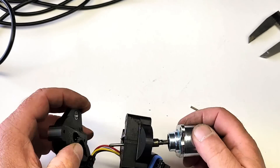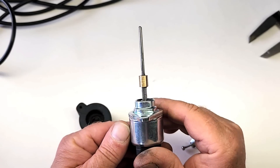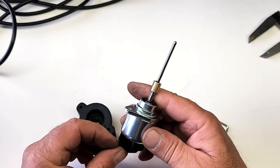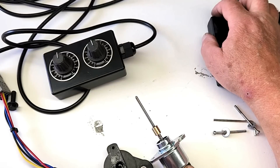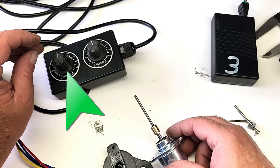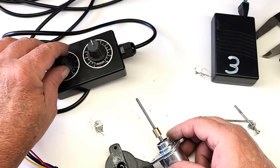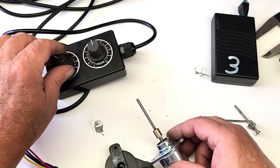Fast forward a few minutes and this guy is apart — the grease is normal, applied to the rod prior to assembly. The stainless steel shaft is press-fitted into a brass coupler, and the brass coupler is threaded onto the jack screw in the stepper motor. Let me show you how this works with all the stuff removed. The first movement is the device searching for home position. Once it finds home position, the step counter in the software is zeroed out, and then the rod moves to the position indicated by the temporary interface. If I twist the knob, the rod can move in or out. This is all done with software magic right now with commands coming from the simple interface, but eventually I'll write the core program and everything will be automatic — the commands to move the rod will be calculated from data gathered from the various sensors.